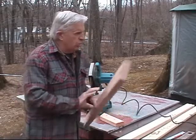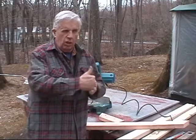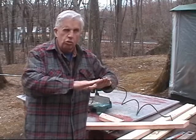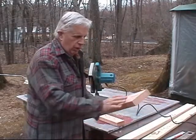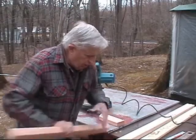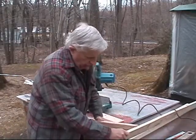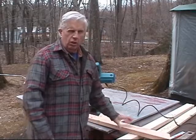And being that these pieces of plywood are only 48 inches long, and the top of that dumpster is 5'6", naturally I'm going to need support underneath so I can butt these 2 pieces of plywood together when the time comes. So I'm going to cut all these identical, and then put the end caps on, the front and back, so that the whole thing will be like a framework. Carry it over there, screw it to the building, we're good to go.